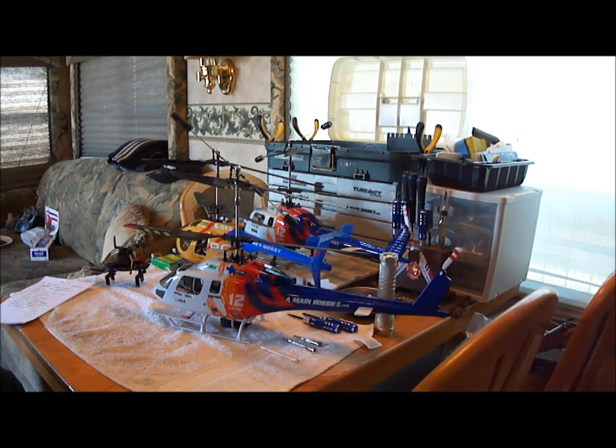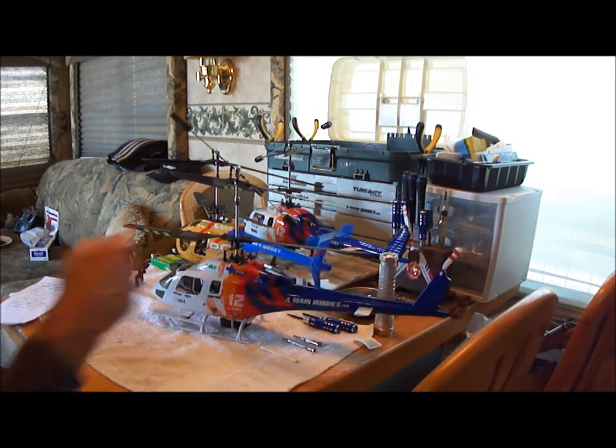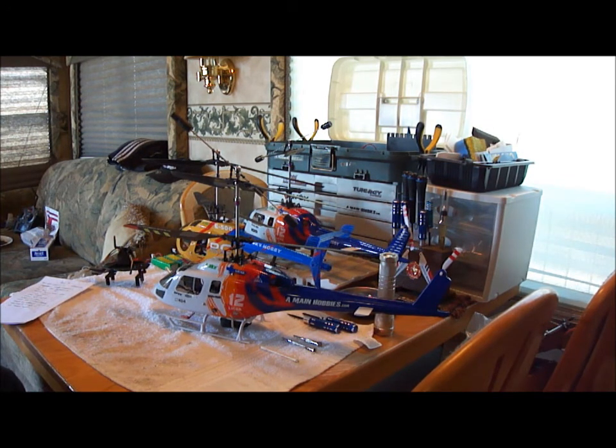A bad motor can also cause vibration. But generally, if you get a bad motor, you're going to know it, because you're going to have problems with your blade spinning, and you're going to have other flight control issues and throttle issues, and it's going to lead you straight to the motors. But that's it on part 3 for chasing down vibrations.